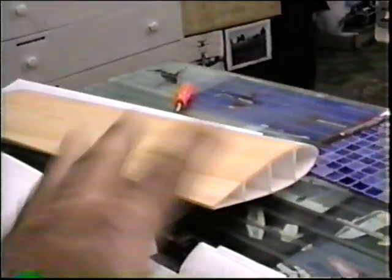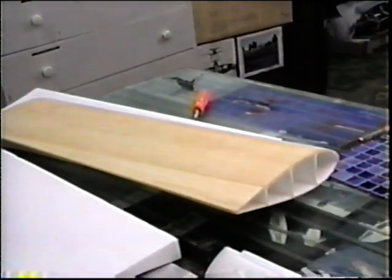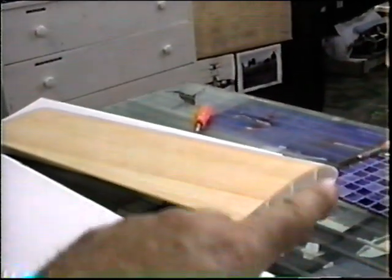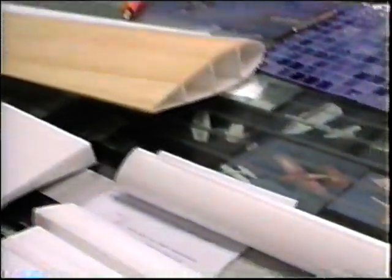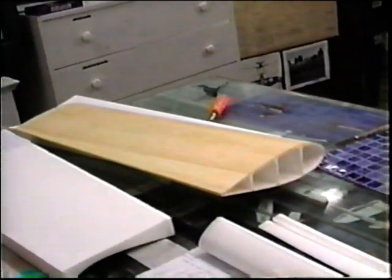The other choice we didn't know is if we were going to just add another layer of fiberglass, another layer of 0.5 cloth, or, when we originally did it, use 3/4 ounce cloth. Both of those choices are possible. Another thing, too, we could take this spar, whatever piece goes in the back here, carefully cut a piece right out of the middle and just pack it in there and put a couple of drops of glue, just to see how much that extra foam would add. This way we can test it out.